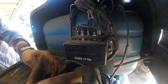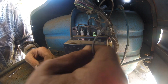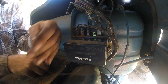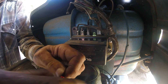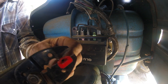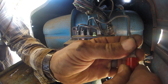So we know that our black wire that we brought up here from that conversion kit, where it plugged into the side of the alternator — this one, according to the directions, is for the warning light. All right, no biggie. Let's go ahead and make that connection. We're just going to do this up nice and neat. We've got this wire hanging out of that bundle, so we're just kind of going to follow our bundle of wires, making it nice and neat, and that'll give us enough slack. We can tie it up neatly, and this is a nice protective little connector.